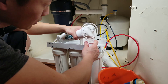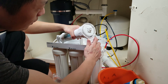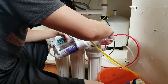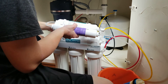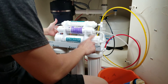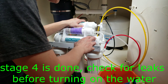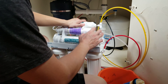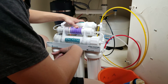Good thing this only needs to be changed every two years, otherwise it's just too much hassle — it goes on really, really tight. Turn to close according to the direction indicated. Make sure the tubing is back into the housing — just push it in and it should go straight in. If that's all you needed to change, just check for leaks when you turn the water back on. Also, the first tank of water needs to be drained out. I would suggest turning on the filter water, letting it drain completely, letting it refill, and then draining it again. The second tank you can start drinking from.